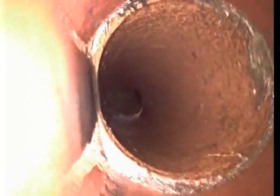Okay, here's another little belly. We're back roughly about 17 feet back from the trough, and we drop into it. And again, it's a pretty healthy one. It's over 1.5 inches deep. And about 3 feet later, we're out of it. And you can see the separation from this angle a little bit better. Another little minor belly there, but it's more of a separation in that clay, at that clay joint. Here's another little bit of a separation with leftover root intrusion. We've pretty much gotten all those cleaned out of here now.